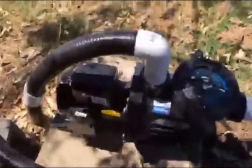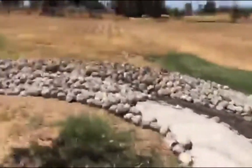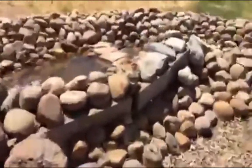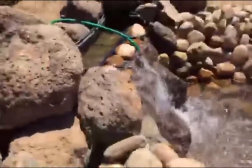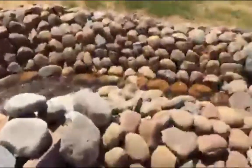I just wanted to make sure my pump — an Artesian 2 pump — was pulling the water. My problem was I had the wrong valve setup: a check valve that wasn't hooked up correctly. I had to cut that check valve out, and cut out the three-way valve that was inside the pump setup, and redo it. But anyway, I'm testing it and it's working great — I'm just days from being completely finished. Just need to cover the concrete area with rocks.